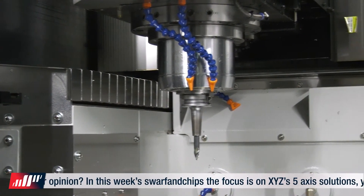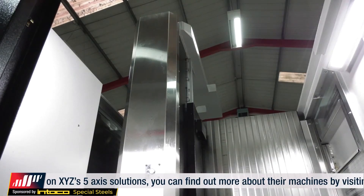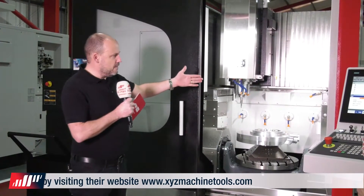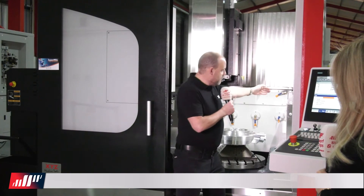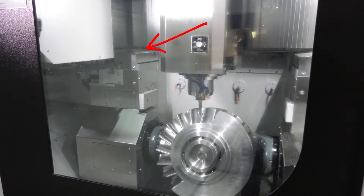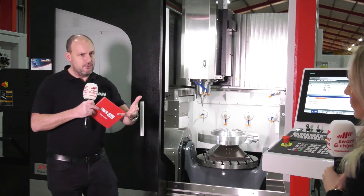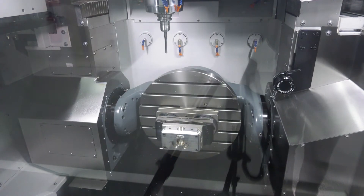The points that stand out on this machine are the gantry style. The x-axis moves from left to right, but it's supported on top of the y-axis which has two supports — like a bridge. Some would argue there is no better way of constructing a machine for maximum stability. As the y-axis comes forward, even at the end of its axis stroke, you've got the same support as when it's extreme in — all the way across. So wherever this spindle positions to machine, whether on the extremities of the table or right in the middle, the security of the machining process is identical throughout. That's very important — the distribution of axis weight.